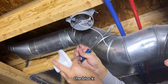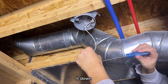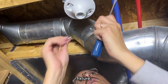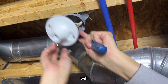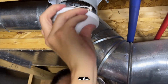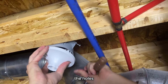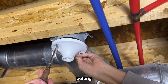Insert the black into the gold screw and tighten it down. Now all of our connections are made — gently fold up your wires into the electrical box. The screws did come with the electrical fixture. You can save a little time by screwing them in partially first, and then the fixture will just go through the holes and you can twist and it will grab on. With the screws pre-threaded, it makes your job easier because as you tuck in and fold up those wires, you can just put the fixture right through the holes, twist the fixture, and it is on. Then just tighten down those screws.